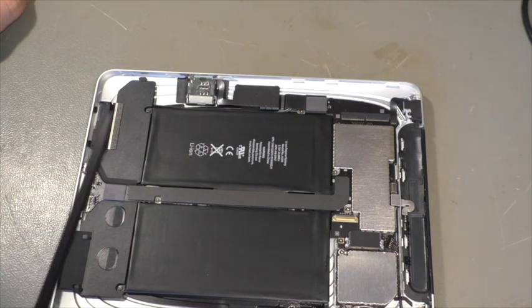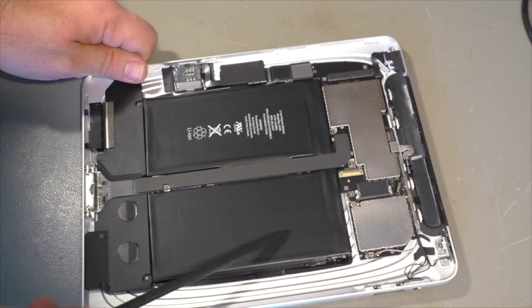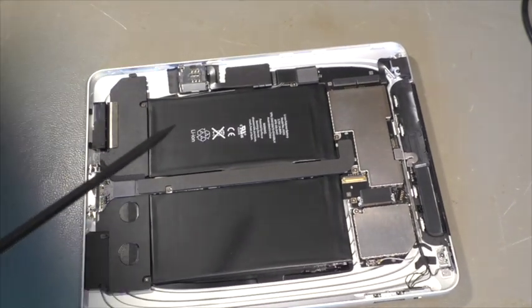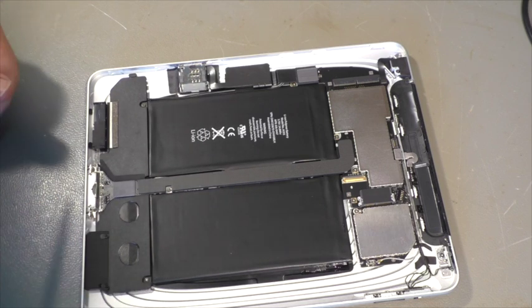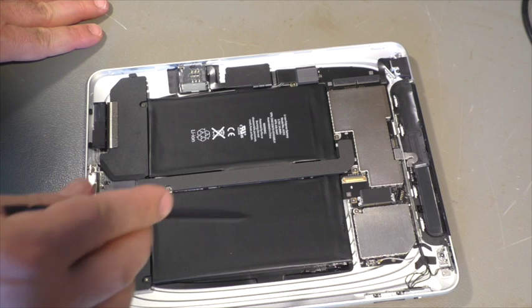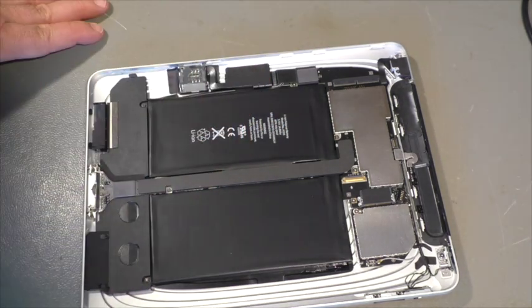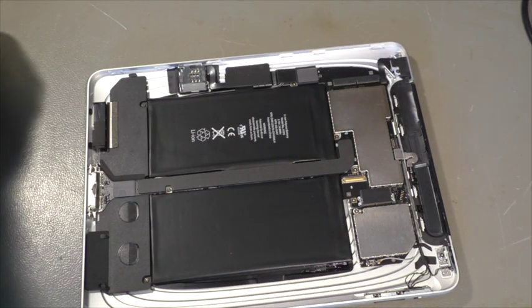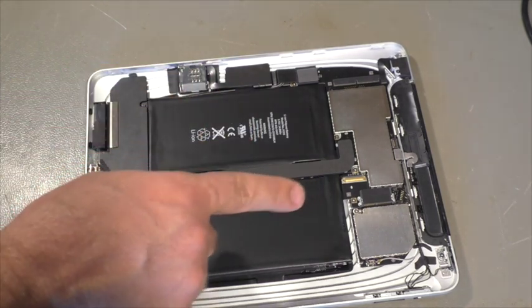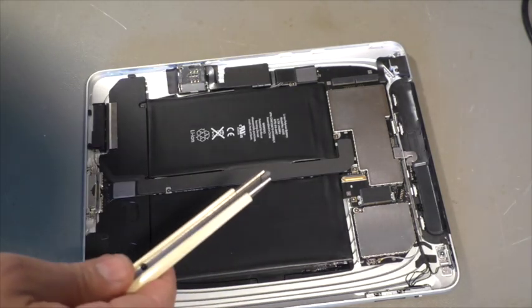What's interesting to me are the batteries. We have two batteries, and as I found out, they are connected in parallel. So we only have to remove the insulator from one battery, because the other is connected in parallel — if we charge that one, we also charge that one. They are not in series, so we don't need a balancer or anything like that.